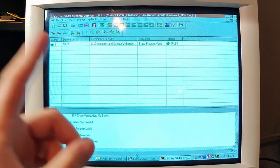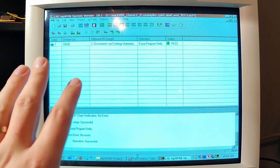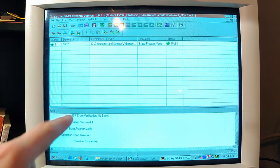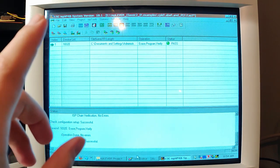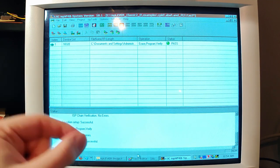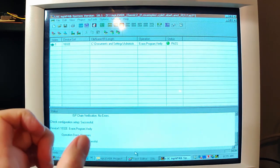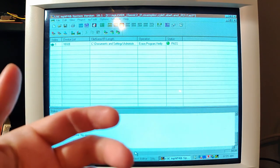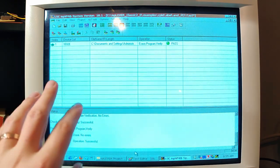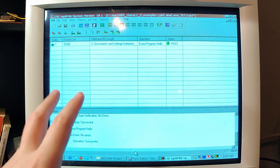For starters, I'm actually not sure off the top of my head if it's a timing issue with the MUXes themselves, but the way they're written, I think it is more likely an issue with the counting for the address itself. What I'm thinking I might want to do is extend the address counter by a few bits, and then I can truncate and send out the higher order bits to the actual physical memory addresses, and use the lower order bits for the muxing.